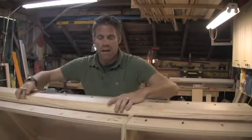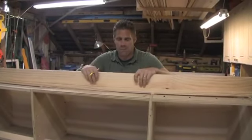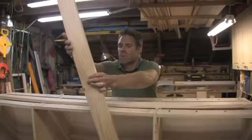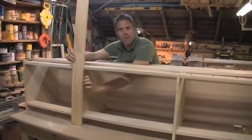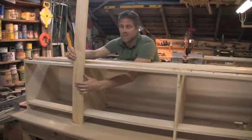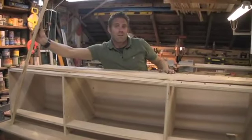So now, 13 inches is our stile. This was a 1x4 material. We wanted to use something a little bit wider. Now, if I was to use this for my rail or my stile, look at all of the space I would lose. There's no sense in doing that, and aesthetically, it doesn't make any sense to use a 1x4. So what we're going to do is use a 1x3 and try to gain a little bit more space.